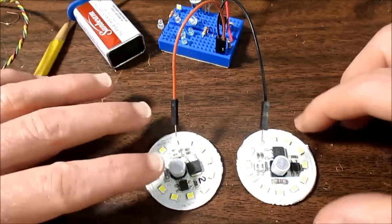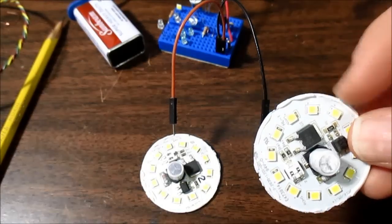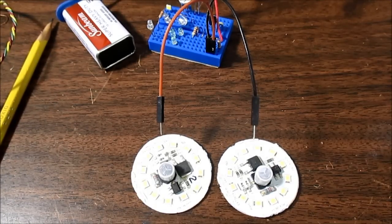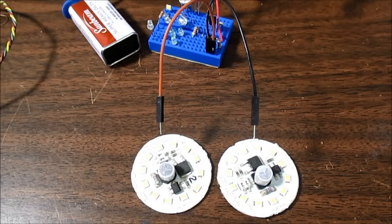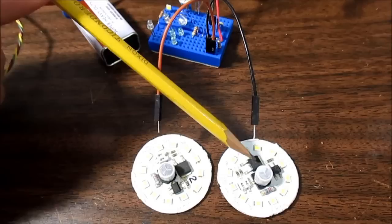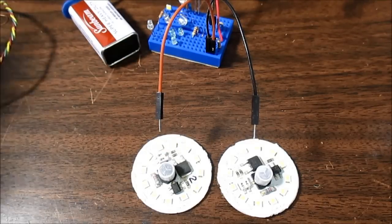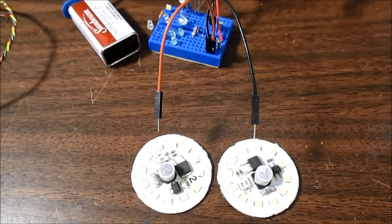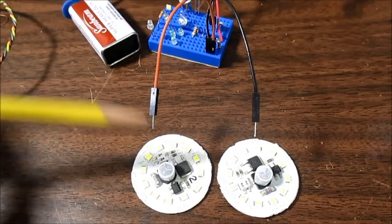I did that on both of them and found an open LED on this one as well. So in the first case and in these two cases, it's dodgy LEDs causing an open circuit and causing them to fail. Maybe there's just a little bit of leakage causing glow in that one case, but I think it's bond wire failure of the LEDs. Normally, if the LEDs were stressed, you'd see little dark spots, but I don't see that here. One more thing I'm going to check is make sure we're getting the proper current. If these have failed and let higher current through, it could also pop the weakest link — which could be a bond wire on one of the LEDs. I don't think that's the case because one of these would run for a couple seconds at normal brightness and then go out. So I think as the LED heats up, it causes some sort of expansion and causes the bond wire to lose connection.